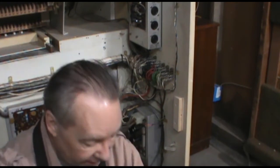Now, the reason that's not a good thing for us land dwellers is because the American electrical grid is a grounded system. The earth is the neutral position. That's why you have a big grounding rod at your home and your water pipes are connected in and all of that. There is definitely a difference in potential between that high voltage line and the ground. And so if you reach up and grab one, yeah, you're toast.